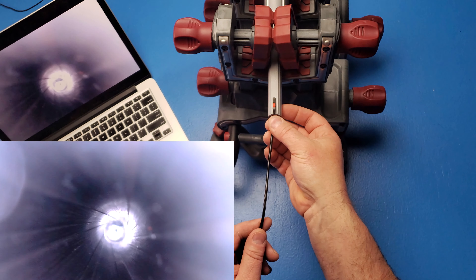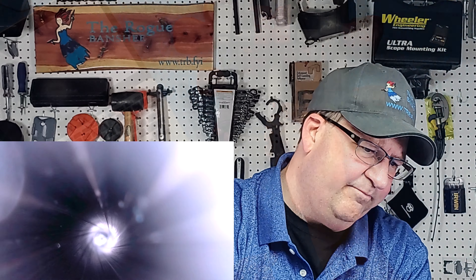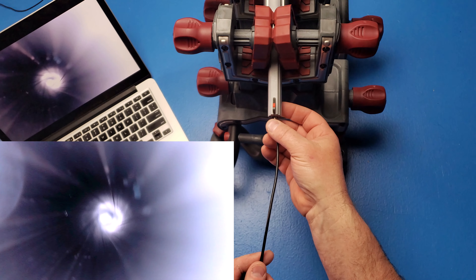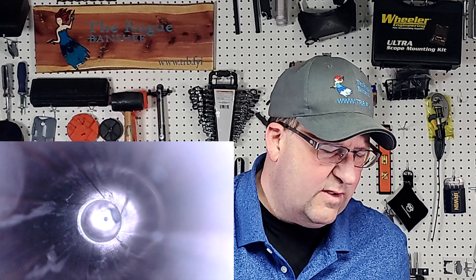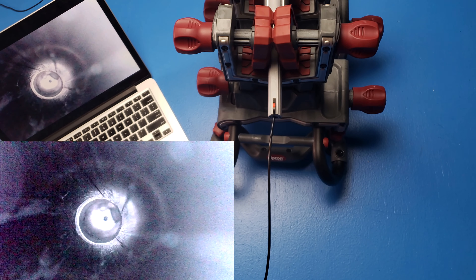It could use a cleaning. It looks like there's some scratches down the barrel, but I don't know if those scratches are from the brush going down — maybe there's some leading on that barrel. This is not too bad, but it is kind of important to make sure that you are cleaning these. What's nice about having a tool like this is that after you clean it, or every once in a while or maybe every year, you borescope all your guns to see if you're actually cleaning them correctly. Right there is a really good picture of that leading in the barrel.